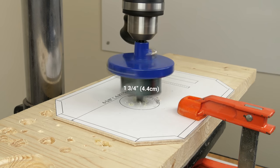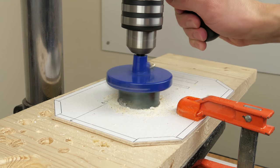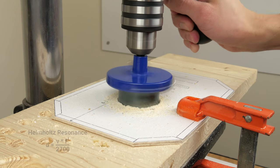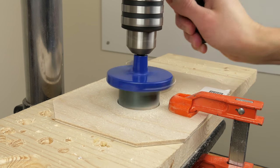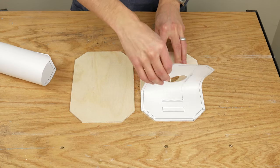I drilled a 1 3/4 inch sound hole into the top piece, the soundboard. The size of this hole was based on the Helmholtz resonance. There's a link in the description to more information. To minimize blowout, I only drilled partway through, then flipped the board and finished the hole on the other side. At this point, I was done with the template, so I peeled them off.